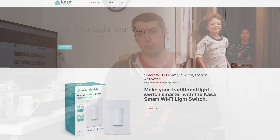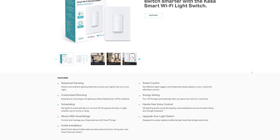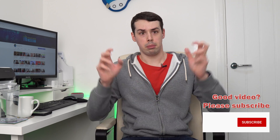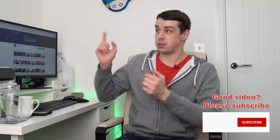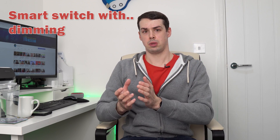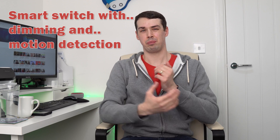If you hate both Philips Hue and Amazon, you can also purchase smart switches that have built-in motion sensors. These can be configured to turn the linked light on and off after motion is detected, but there is a clear downside. Smart switches don't usually work with smart light bulbs — they are designed for dumb bulbs that they specifically wire to in your home's electrics. So if you go down this route, you can have motion-activated lighting but won't have RGB support, and you'll probably be stuck with 100% brightness, unless you find a dimmable smart switch with built-in motion sensing, but these aren't too common.